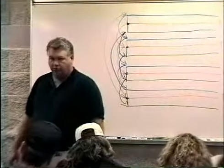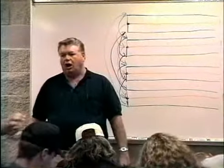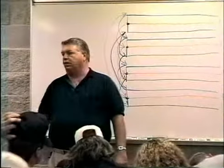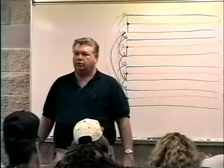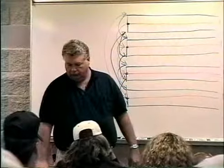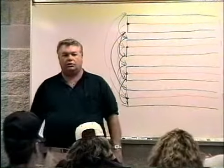That hydraulic system's oil consistency is going to vary according to the temperature. When you're operating the system and it's really cold out, that oil is going to be less fluid than when it's really hot out. Therefore, it'll run faster when it's really hot out, and it'll run slower when it's cold out due to the viscosity of the oil — the temperature change changes its viscosity.